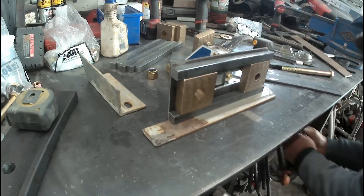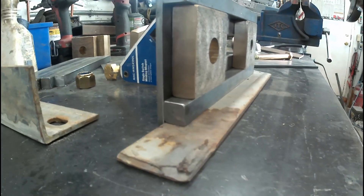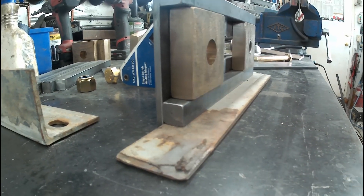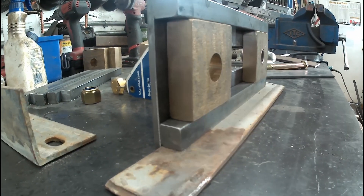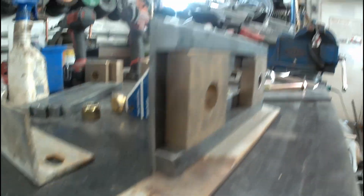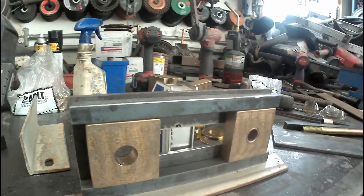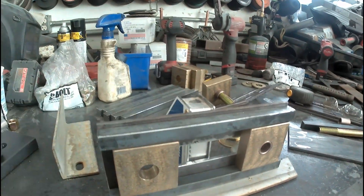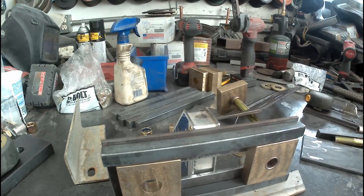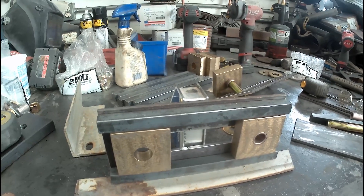What we're going to be doing is setting it up on the table here, using a 3/16ths piece of flat bar as a spacer, setting the 3/4 inch square stock on top, then two of the brass bushings to keep it equal between, then the next bar on top of that. That leaves us with a tad over 3/16ths up there. As long as we keep the tops all the same, we shouldn't have a problem — everything should line up.